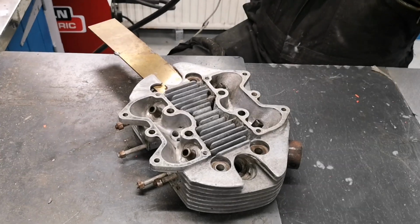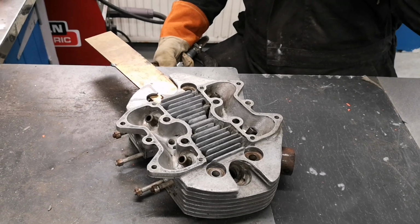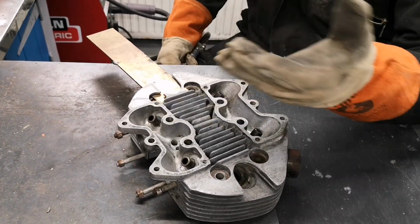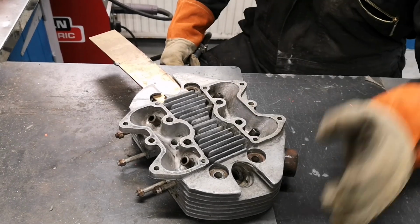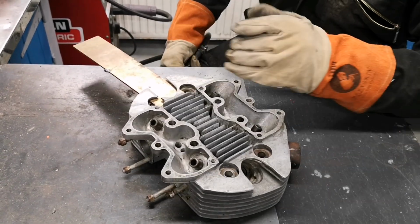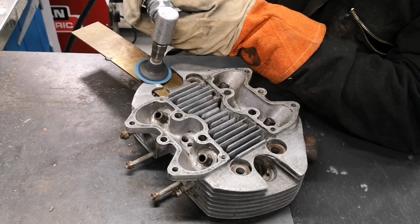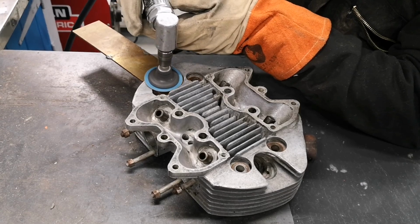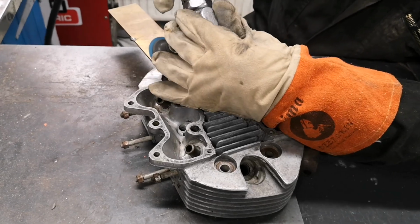So we're going to be like a bit of a spy cam and watch Nige do his stuff with my cylinder head. How we're going to start now is we've got to clean the area where we're going to weld, and we're going to put a prep on a part that we're going to be welding up. So when we come to clean it, there's enough for us to take off, and you've got no undercut as well. So here we go. I'm going to put a prep on the part as well, put a bevel on it.